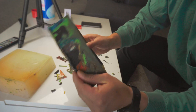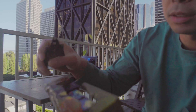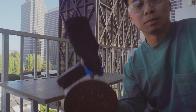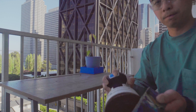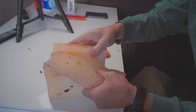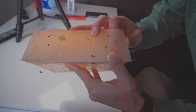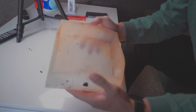It's coming out pretty well. You can see this wall on the side is really thin — there's really nothing to support it, so it's getting pushed out, meaning it's not coming out square. On the next design we could make it thicker so it doesn't push out like this. Here it is — not the best, pretty thin in this part, but overall not terrible. This is what we wanted — a container. I'm going to grind up the edges with some pliers and snip off the soft bits. It started breaking right at that spot — that was that extra pour. I can see the seam line right here. Now I have this big giant slab; I could try to do something by hand with it.